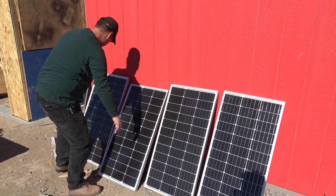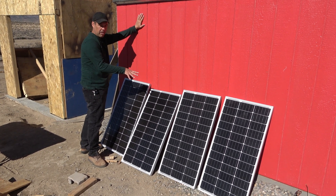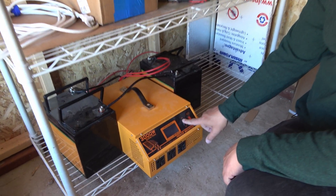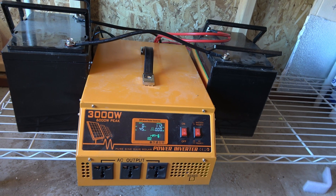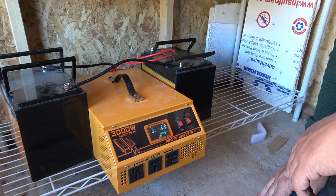Eventually these will be permanently mounted. I want a different system that will power our well pump, and these panels will go on this building once it's finished. Now that everything's hooked up, I can turn this on. With four 100-watt panels, we'd probably get about 350 watts actually coming in. We do have power coming in, and I can now run an air compressor and some power tools. I am going to be installing other solar power systems in the future to get that well pump on solar, and we have a number of other projects planned as well. But that's going to do it for this video — thanks for watching, I'll see you again soon.